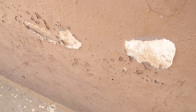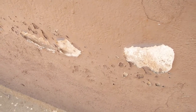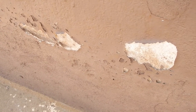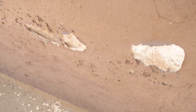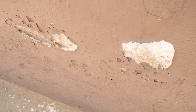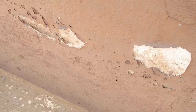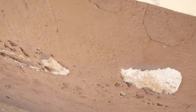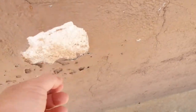Thank you very much. Here's one of the more common problems we find with paint jobs here in Tanzania. This is a cement-plastered exterior wall where they started with a latex-based paint and then probably put an oil-based paint over the top of it. Unfortunately, latex or emulsion-based water-based paints don't do well with concrete plastered walls — they don't soak in very well; instead they form a hard enamel-type coat over the surface, whereas oil-based paints tend to soak in, requiring more coats but actually getting good penetration and a good bond with the material.